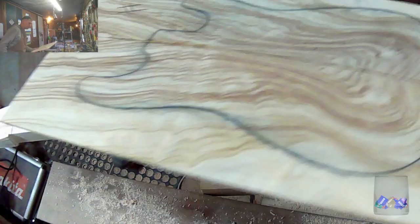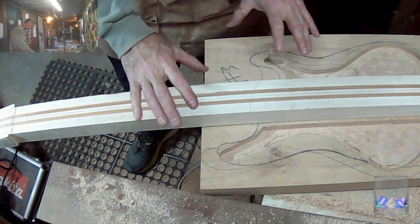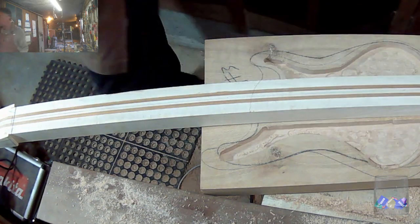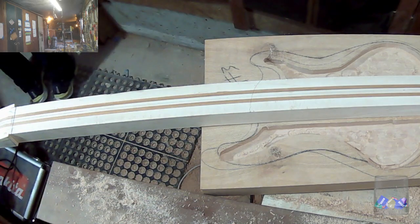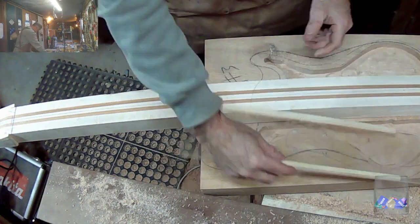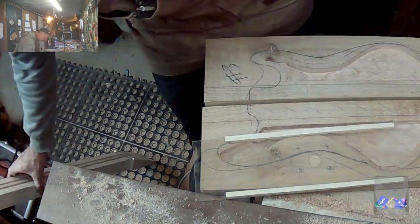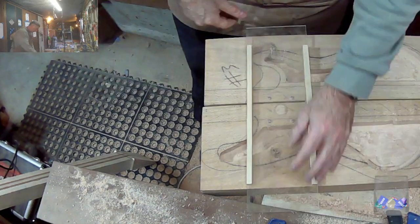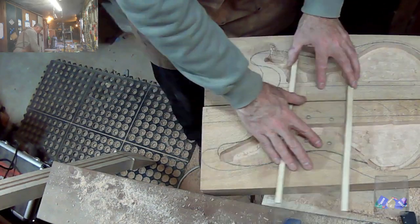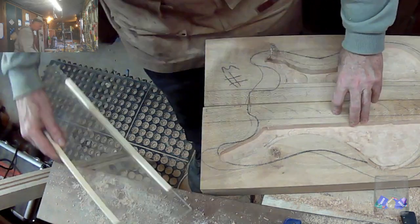And I'm done. I'm exhausted. So I've got to clean that guy out. I'm going to get the other base plate for that router. I've got a big Perspex, and I've got this guy built specifically for the cavities. So we're going to pop this guy down onto the router, screw that into the base of the router, and that's going to give stability over that whole surface. We're going to go in here and clean all those up, get all that nice and flat and clean, and then we'll have those chambers the way we want them to be.